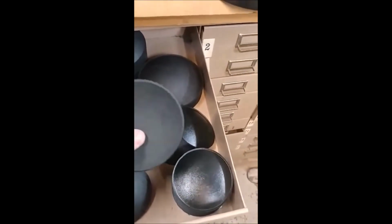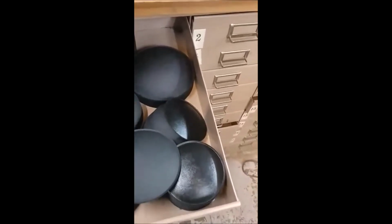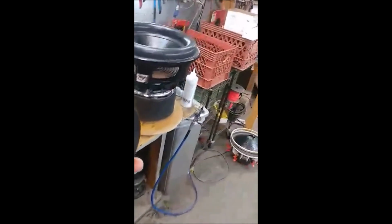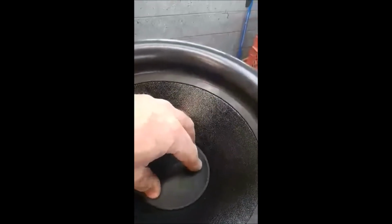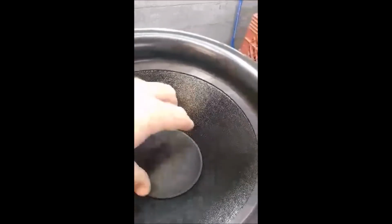And so these are very thin. I mean, they're okay stiff, but not on their own. And so what I do is I actually use our Devil's Jizz epoxy, and I laminate 2 together, and that makes it super strong. And then I seal it in. So I'll laminate them together, and then I'll pour a bead around there, and then let that sit at least for a couple hours, if not overnight.